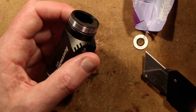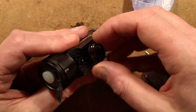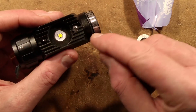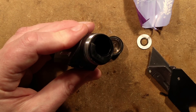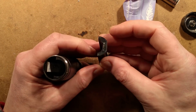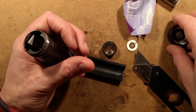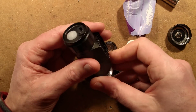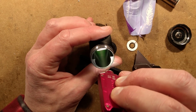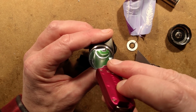I think we're going to have to open this up. This bit unscrews, and when it unscrews it reveals a standard collimator and the LED on a circuit board in there. There's also this little wedge. You can also see the melting that's happened at the end here. A lot of the heat has been around these springs - it has shorted out. I think the only way I'm going to get the rest out is because this is machined aluminium with a close-fitting circuit board at the other end - I'm going to have to take the end cap off.